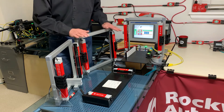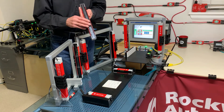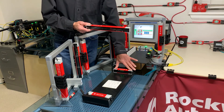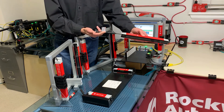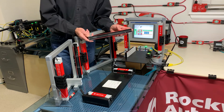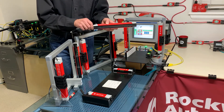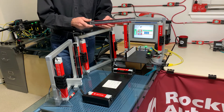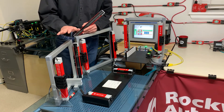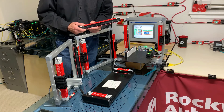The resolution of these comes in finger resolution, which is 14 millimeters, or hand resolution, which is 30 millimeters. The lengths of these are approximately six inches to approximately six feet. And of course, these are capable of achieving SIL 3 or Performance Level E, as you define by your safety assessments. And very shortly, we will also look at configuration and diagnostics using the free Connected Components Workbench software.